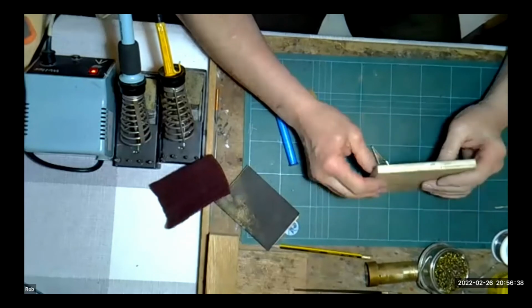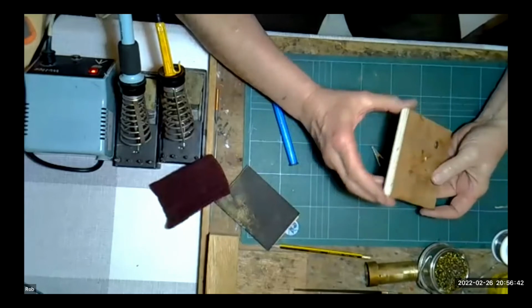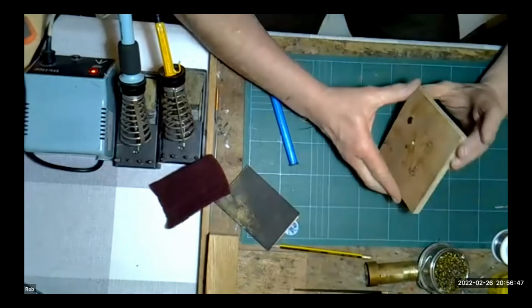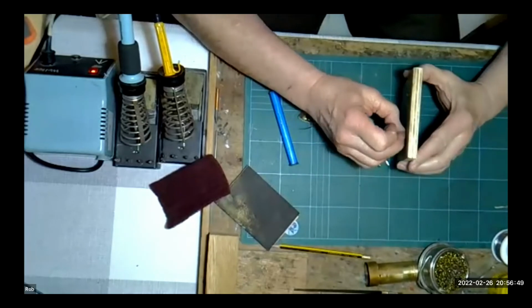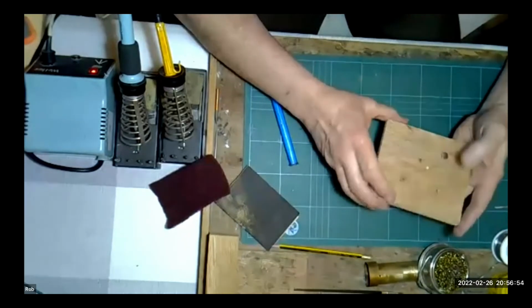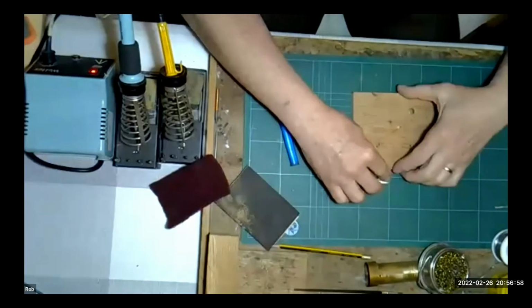Okay, thank you. What material are the jig pins used so you don't get that soldered to the coupling rods? Right, this was something I knocked up very quickly before we started this session this evening, and they're literally two galvanized panel pins. And they haven't taken solder because they're not clean. They're actually probably quite grimy as far as soldering goes, and the solder didn't stick to them, which I was hoping it wouldn't for the demonstration.